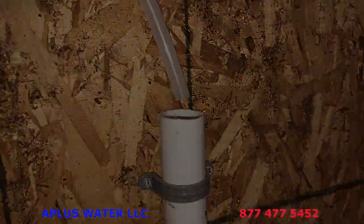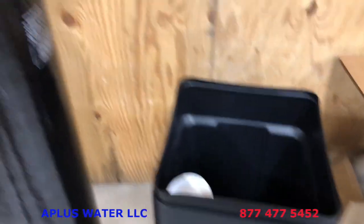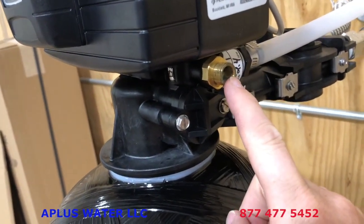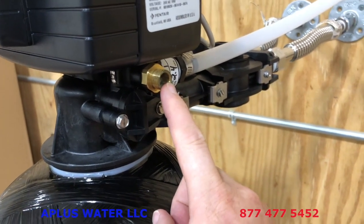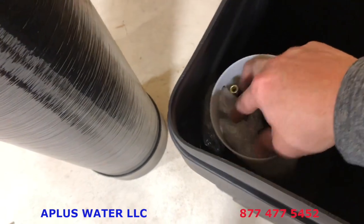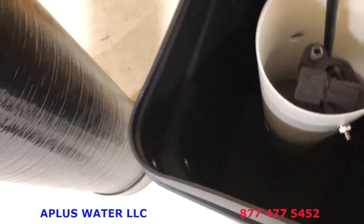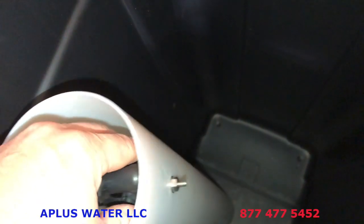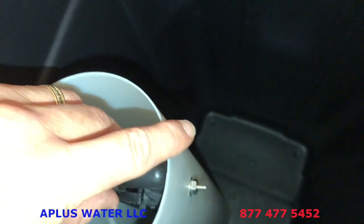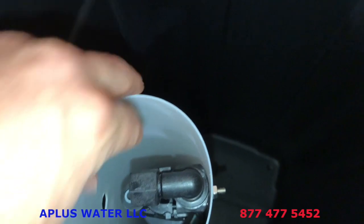It is time to connect the control valve to your salt tank and the safety float. Set up the brine tank and where you connect it is this brass fitting on the side. Inside your salt tank — your brine tank — take the cap off the brine well; your brine line hose and a little baggie are in there. Get your brine line out. You can see the safety float is in there as well — there's a stainless steel male threaded nipple that sticks through. There's one small hole on this side of the brine well and two larger holes on the other side.